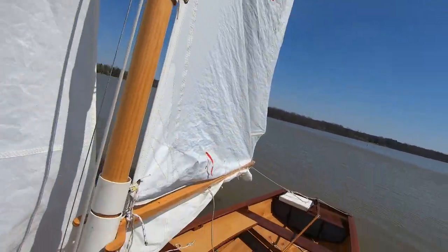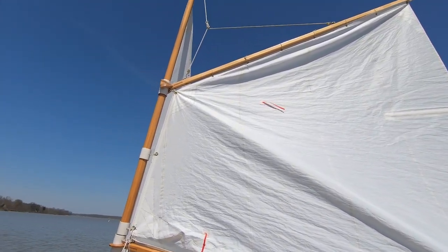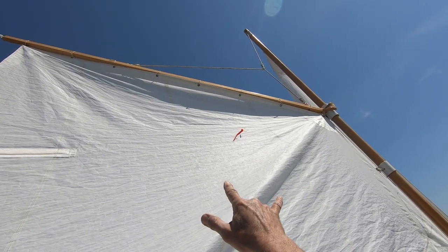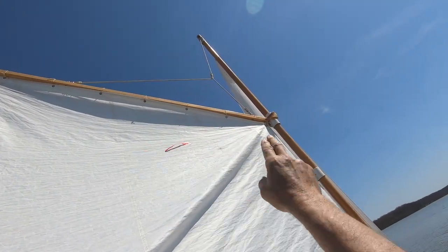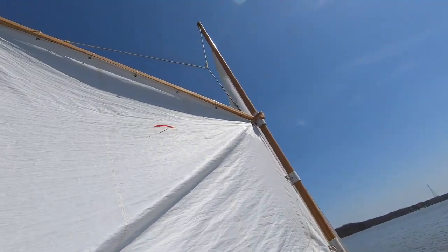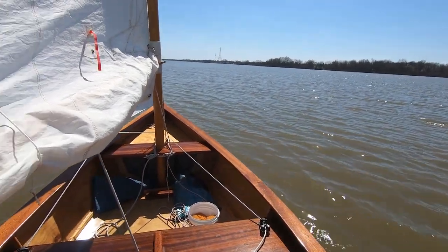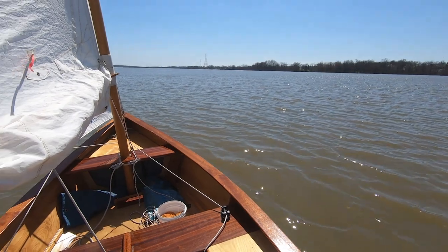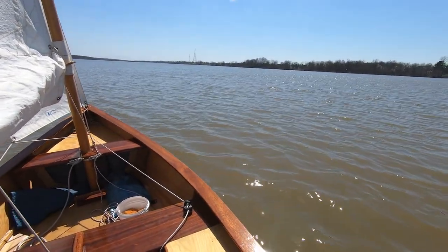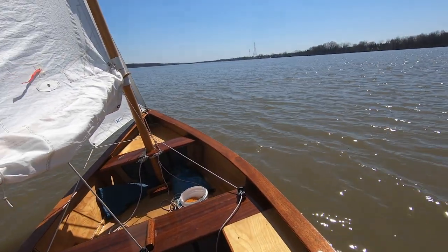Not the greatest shape in the world. There's a diagonal across there that I don't really like — the only answer for that is more peak tension. But we're moving. And that's the key about reefing: you can luff, but at some point you're just kind of holding steady to keep from getting knocked over, and you're not able to make way, especially upwind. So with the reef sail, you can actually maintain headway in some of these marginal conditions.